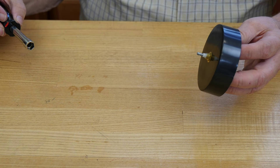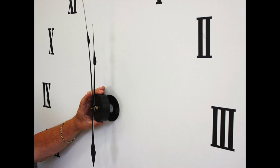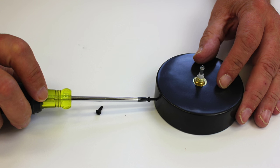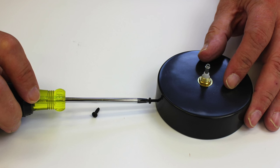That's it for the clock movement. Now install the clock hands as indicated with your movement choice. Install a fresh alkaline battery. Time to install the movement holder to the wall mounting bracket. Align the two small holes in the wall mounting bracket with those on the movement holder, then press together and install the small screws through the mounting holes.